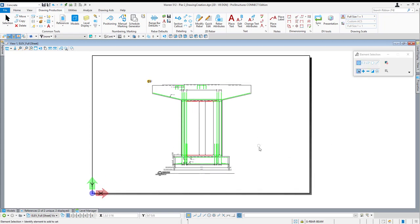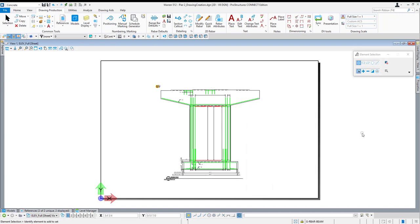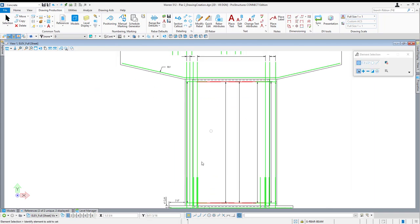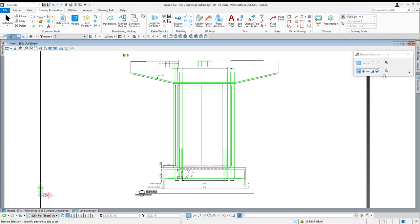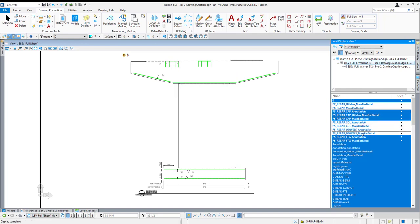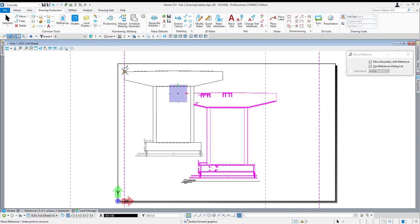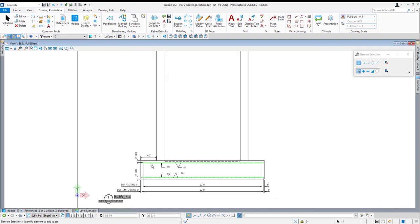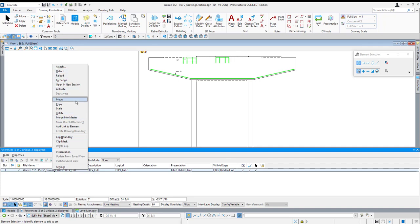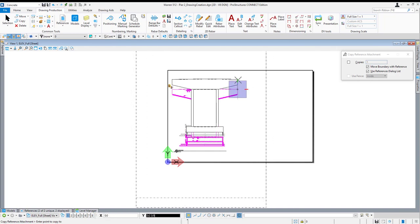What I'm going to do is navigate to our sheet model. You should see the full — but only partially detailed — view already. We're going to turn off the levels we turned off in our drawing model so we're hiding the same elements — turn off all column and dowels. That looks better. Now I'm going to move this, say move reference, and pick an area over here. With that set, I'm going to move the drawing title down a hair and copy this reference right on top of itself — basically setting myself up for top and bottom clip boundaries.